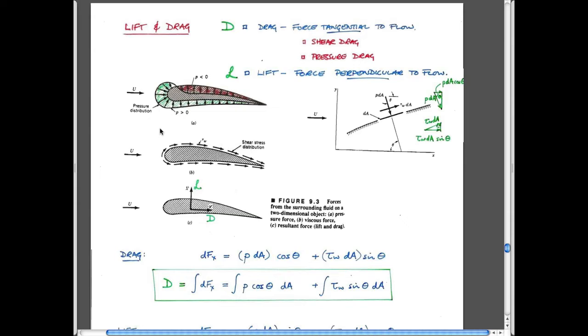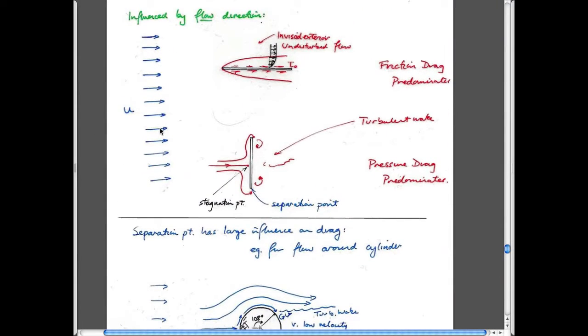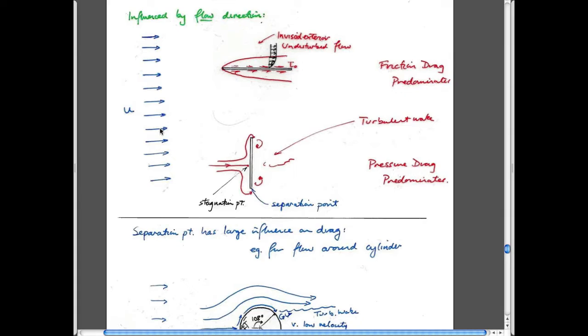Lift and drag arise from two effects. The first: if air hits you in the chest, the air travels at some velocity far away but is at zero velocity on your chest, so there's a force applied by killing the fluid momentum — stagnation. For a vertical plate, you have a stagnation point, the flow goes around it, and the pressure applied over that area gives the force you must apply to resist it.